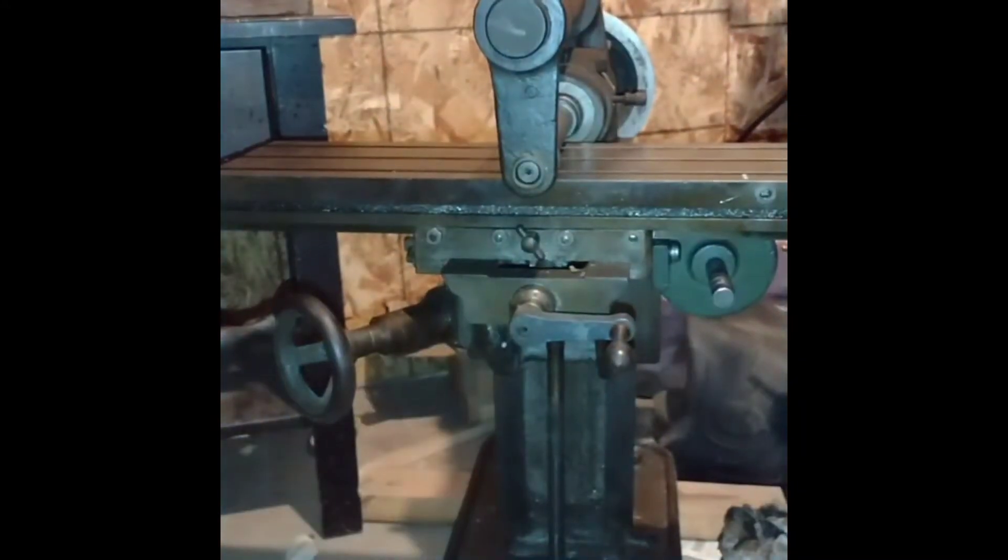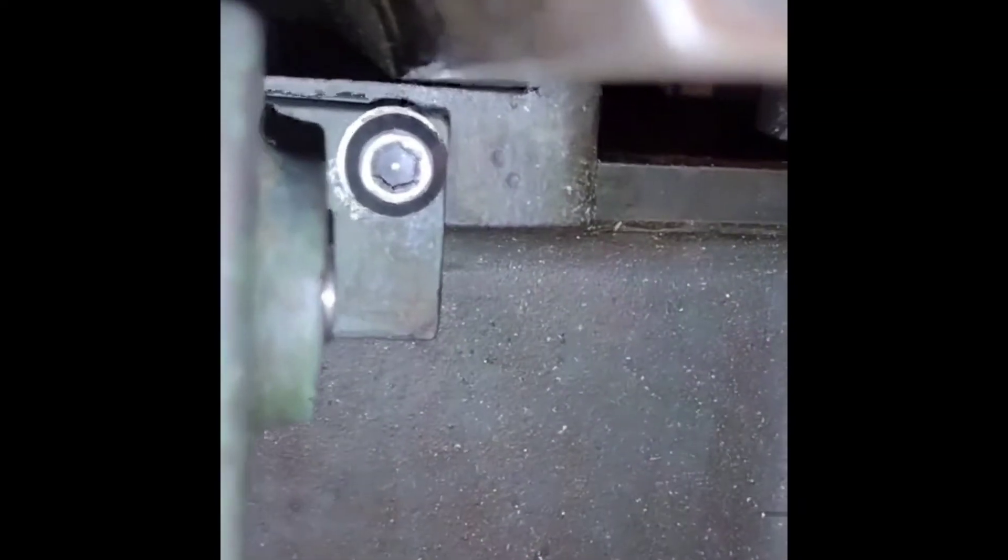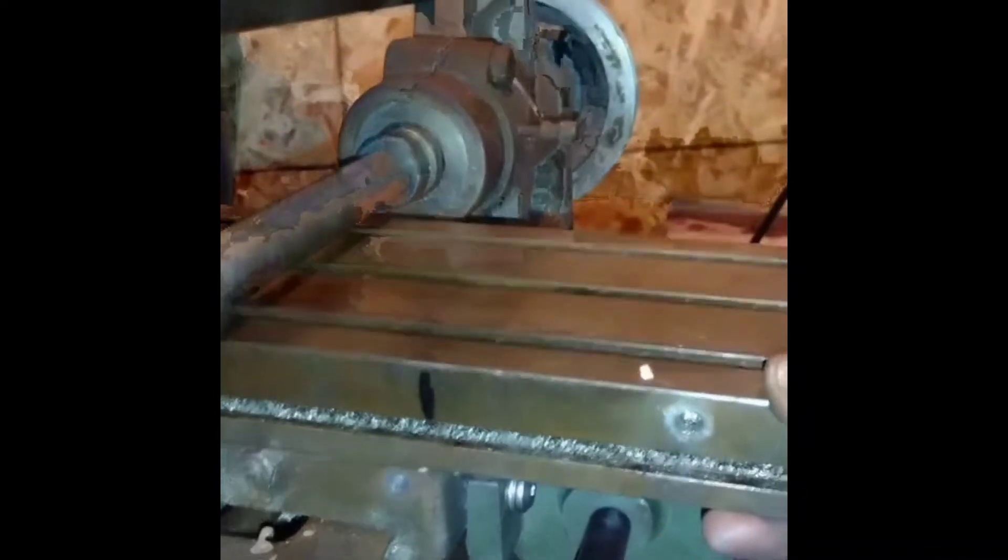Here is the Benchmaster and this is the attachment I just put on. I got the two bolts holding it back there — didn't strip the casting like I did with the smaller bolt size. I'm enlarging the holes they went through so that the pinion is hitting the rack properly. Before, it was binding about halfway through.